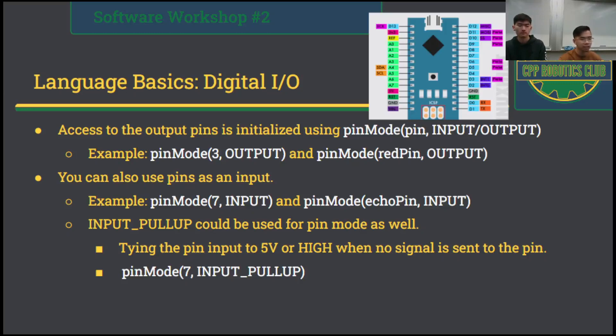The syntax for INPUT_PULLUP is: use pinMode, set pin 7 to INPUT_PULLUP, which means it's input, but when it doesn't see anything, it pulls it up to 5V to give the pin a definite state. One thing to mention is that the Arduino can only do pull up through software. Last time we did the hardware approach using a pull-up or pull-down resistor. You can use a resistor, but it's a little easier — if you want to save some resistors — to use the internal pull-up. Remember, we can only pull up inside Arduino; if you want to pull down, you have to use an external resistor to put that to ground.